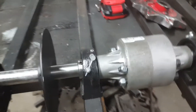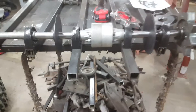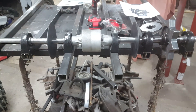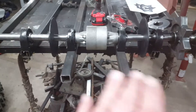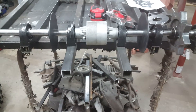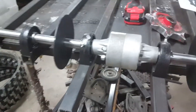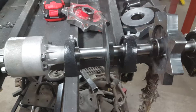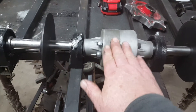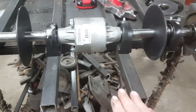It's very important that the axle is completely straight and solid. That's why I didn't try to build the frame first and then set the axle in it. I actually used the axle as the reference plane so everything would be level. The axle is pretty straight and short — there's no wobble on it — so it's imperative to build your frame to match that.